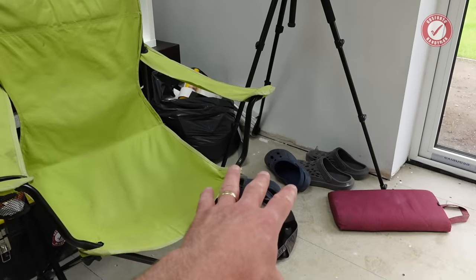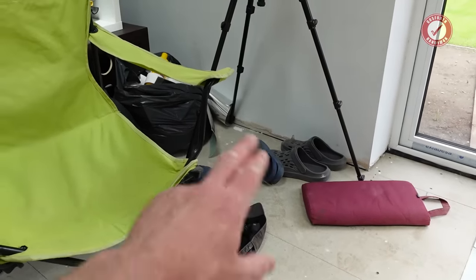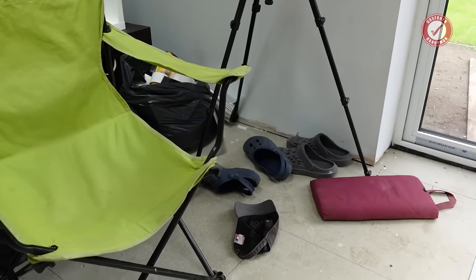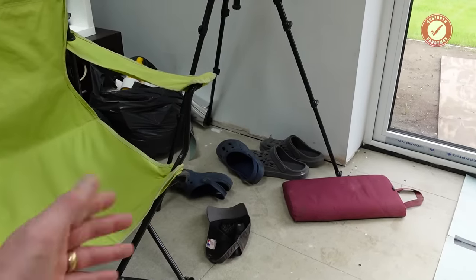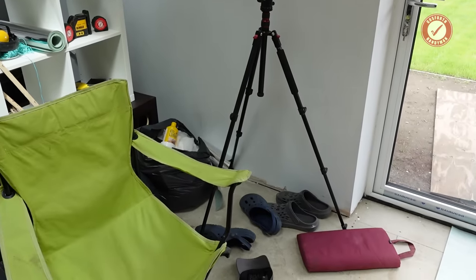So there's going to be kitchen cabinets under here, underneath this. I should really have tidied up before filming this. Anyway, if we do have to bring it back to being perfectly straight, I can put some very, very small gaps in, but I can just pull it back to being in a line by putting the gaps underneath kitchen cabinets where you'll never see the gaps.